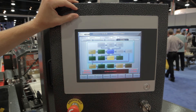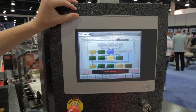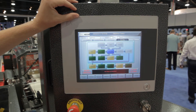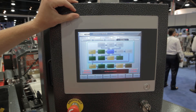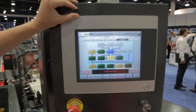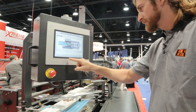This is useful because PackML allows upstream and downstream communication between machinery. So the feeding machine upstream would know that it needs to stop sending products down to the shrink wrapper because it's in a suspended state. And when the shrink wrapper is back up and running in execute, the upstream machinery can start sending products to it again. The advantage of having PackML on the machine is that it's part of a line of machines that all implement the same state machine.